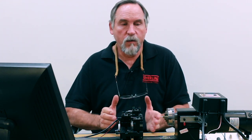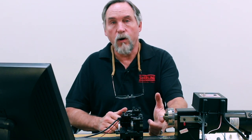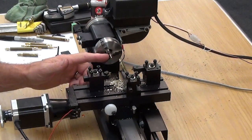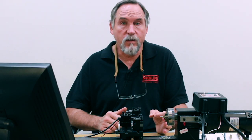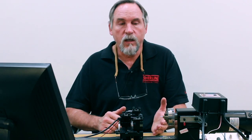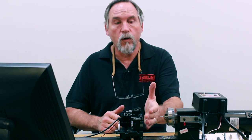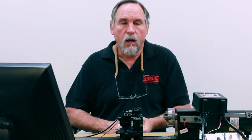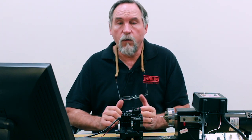So what I did was use the G32. This is brass, so obviously this is not hard material, but the depth of cut that we're taking is a hundred thousandths depth of cut with a three-eighths inch boring bar, which is easily twice the depth of cut that you should take with this tool and on this machine. We don't recommend more than maybe fifty thousandths depth of cut. That's a pretty serious cut — you're better off with 25.